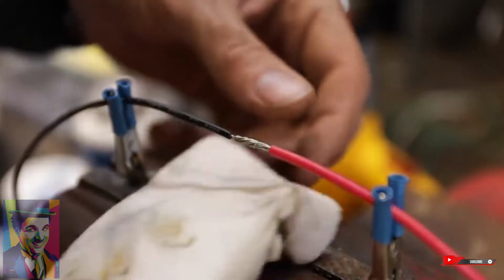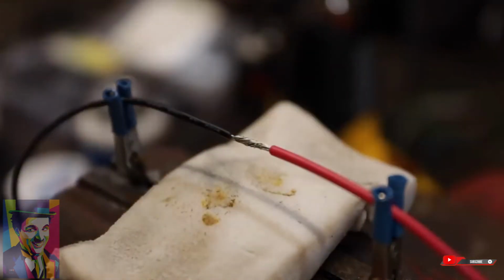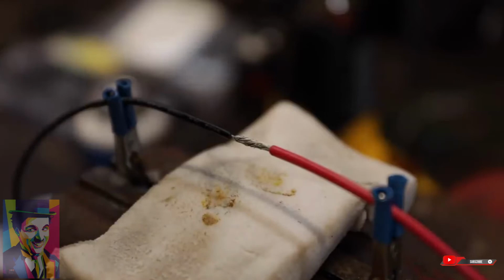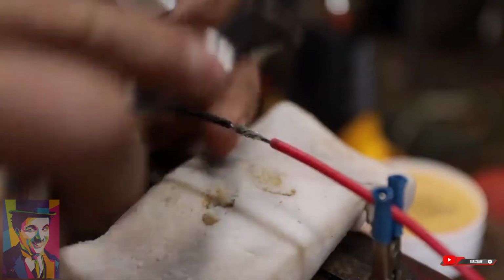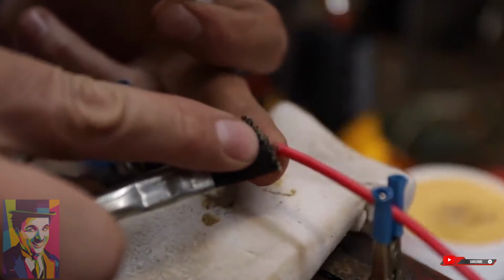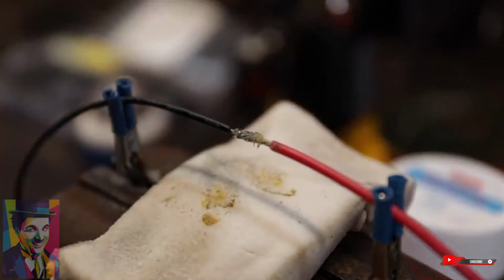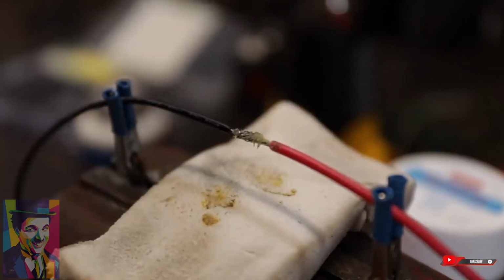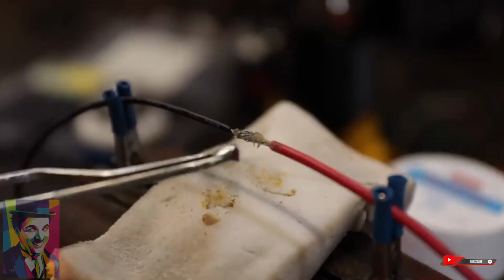I don't think I mentioned you want a damp sponge too. Any sort of old worn out sponge would be fine. Now with everything ready, you're going to take your rosin flux and apply it on there like that. Just coat that on there, and that's going to help the solder to bind. It probably wouldn't be a bad idea to have heated that up first. And then we're going to get our soldering iron and untangle the cord that hooks on everything.